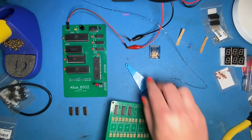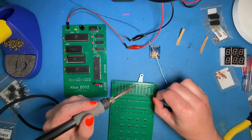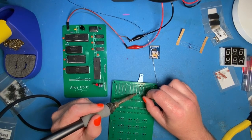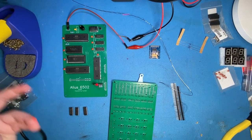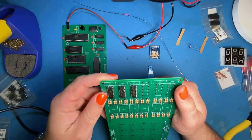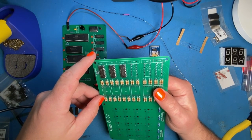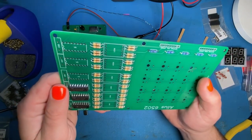When I was designing the hardware there were design decisions on how to physically wire this up. By putting the SPI bus clock line on bit zero of the IO port, I can toggle the clock line by just doing an increment or decrement instruction — rather than having to load a register, change it, and set it twice. I can literally do increment memory, decrement memory, and that will toggle the clock bit. So even though it's inefficient and slow there are things you can do in hardware to shave a few clock cycles off. I read it somewhere on the internet — it's a reasonably standard trick, and as soon as I saw it I went yeah, that's obvious, I'm going to do it.